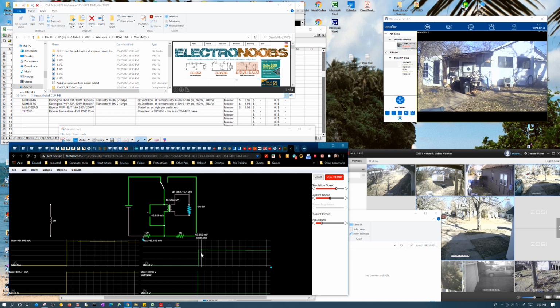So, like before, at 100 times that, we were seeing 5 volts across it, right? But now we're only seeing 50 millivolts across it, because the ratios are so much different. It's interesting. This is going to take me a while to chew on, because this all works so backwards. It's not that surprising, given how inductors are seemingly backwards in every way. It does make sense that with a smaller resistance the current going through it is going to be smaller compared to this resistor, so it's getting 10% of the voltage and 10% of the current, or 1% of the voltage and 1% of the current.